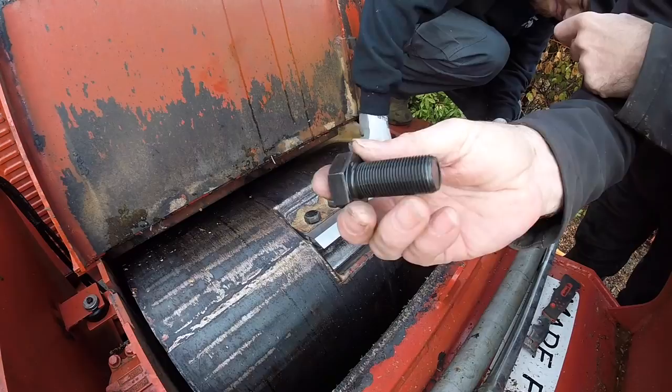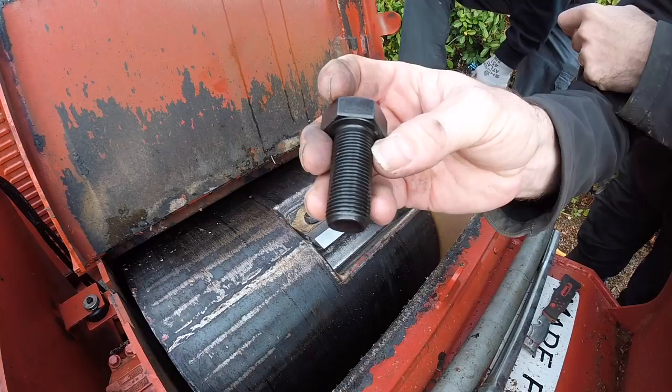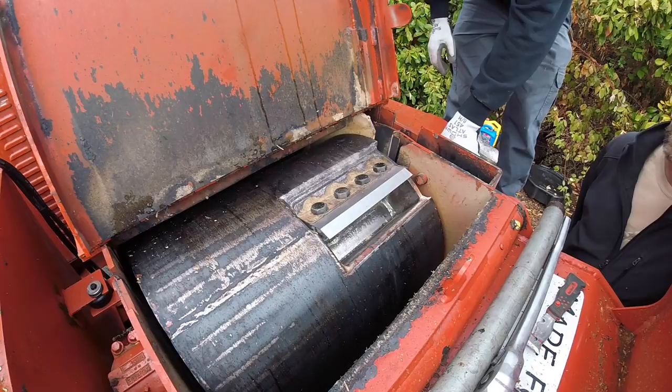Morbark has some sort of sticky film or residue on the bolts — maybe that's why they're not calling for the silver anti-seize anymore, or maybe it's because you're supposed to change them all the time anyway. So we'll check for initial clearance by hand, just by turning the drum gently.